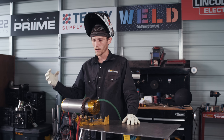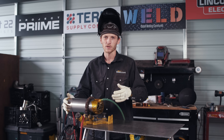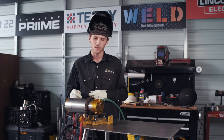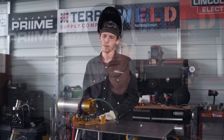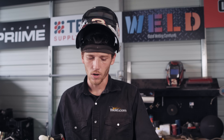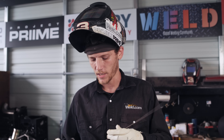They also make aluminum end caps, silicone caps — there are all kinds of different ways to purge it: tape, painter's tape, whatever you have. Now with the piece on purge, I'm going to burn some heavier tacks and then go through the weld process. If you want to know exactly how long it takes to evacuate all the oxygen, there's a chart online. For a four-inch piece of tubing at 25 CFH, it takes one minute to evacuate all the oxygen. It's been a few minutes, so I'll go ahead and burn some heavier tacks.